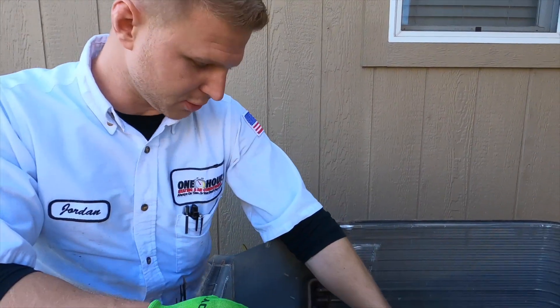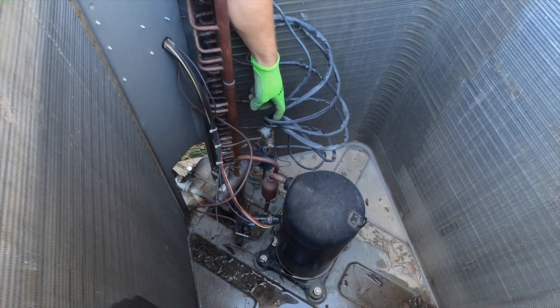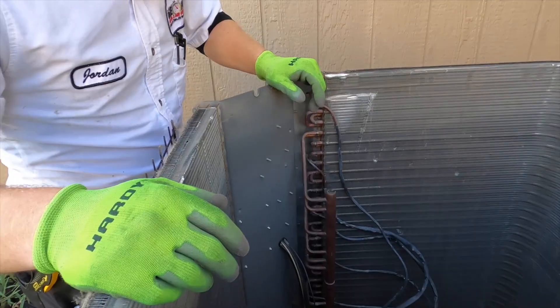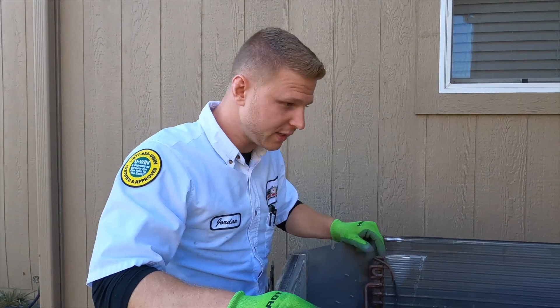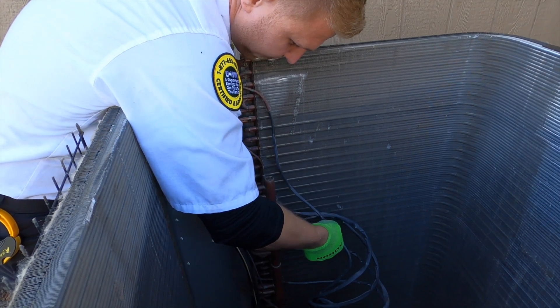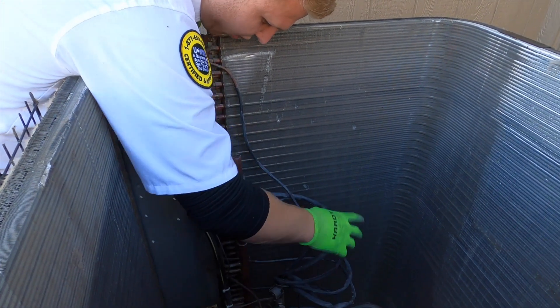It'll leak quickly, but it's very hard to spot because you've got this bundle of tubes and way down there you've got them rubbing together. Then boom, you've got a small leak hidden by the two cap tubes touching. It's a very easy fix but a lot of people don't do it, unfortunately. Preventative maintenance — something so simple but can be such a problem.